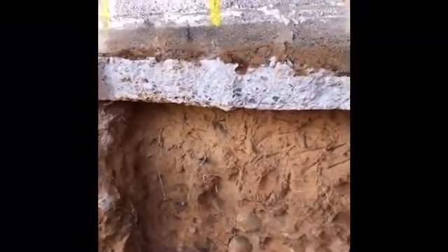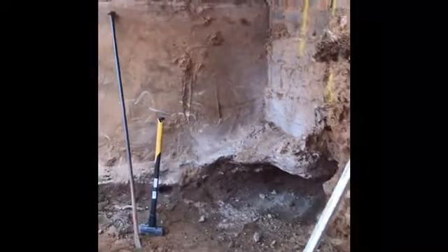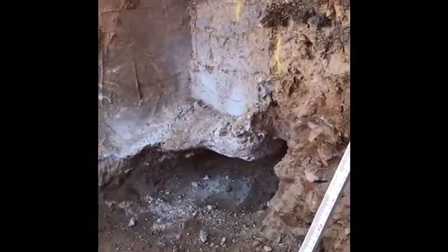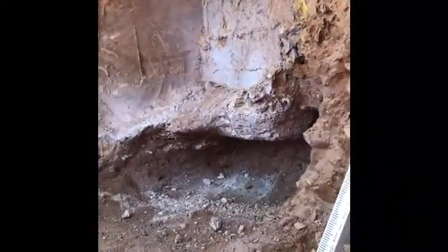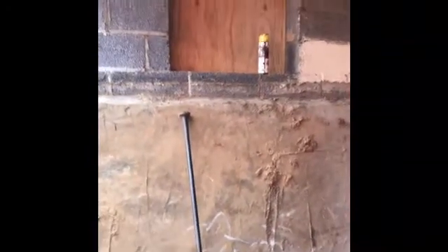You can see the old footing is about five feet above our new footing level, which is not good because that means we're undermining our footings. This footing is about a foot above our old footing in the basement. On the other side of this wall there's our old crawl space access; on the other side of this wall we have a full basement — that wall is going to come down.